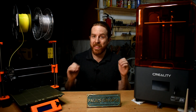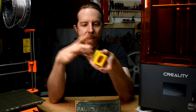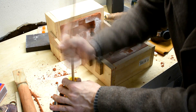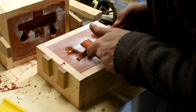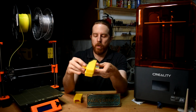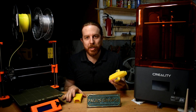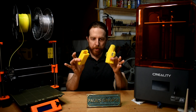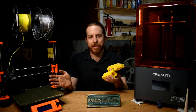And sometimes you need a mold for the sand, called a core box — I've printed those too. This is to make a lump of sand: you force the sand in here, pull it out, and this goes in a pattern for a hammerhead casting. Here's the 3D printed pattern from years ago — that part goes where this lump is and goes through the middle, giving you a hole in the finished casting for the handle to go in. All 3D printed — well, on an older version of this printer, but it would do it on this one too.